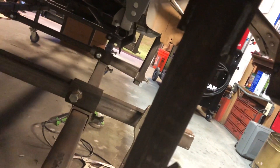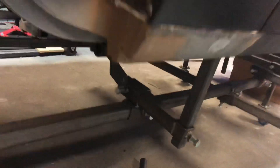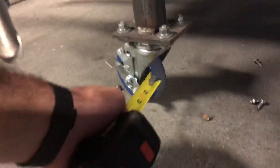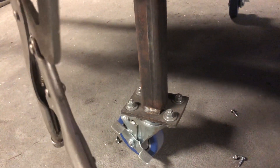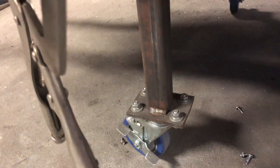The arm lengths will depend on how high you want to raise the car. These vertical arms are inch and a half — they don't need to be real strong for this application since there's no weight on them. The plates are 3-inch by 4-inch, quarter-inch thick. The wheels are polyurethane casters off Amazon — search 'polyurethane casters.' These support around 250 to 300 pounds each, which is overkill. The chassis without anything should be under 1,000 pounds.